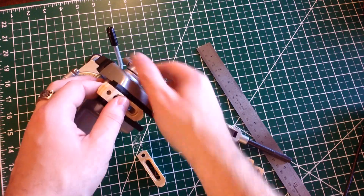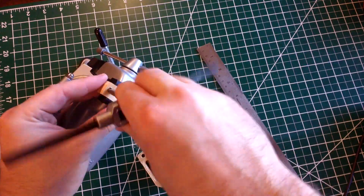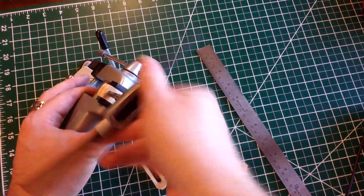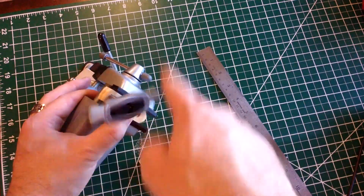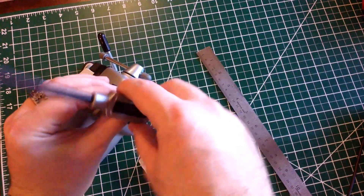Okay, so I'm going to go ahead and tap these clamps. I know it's wood so it's not going to be the strongest threads. However, I'm not going to be clamping that tightly, so I think it's just going to be fine. I've chosen to go with M6x1 threads here since it matches the holes that are already present in my Nomad, and it will also fit the OEM plate that Carbide sells that comes with the array of threaded holes, so this is just good future-proofing also.